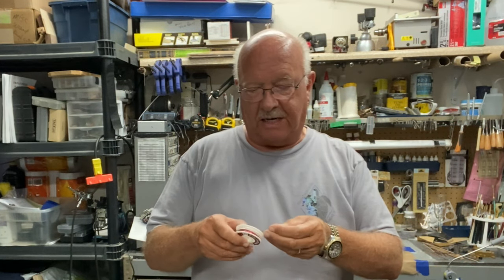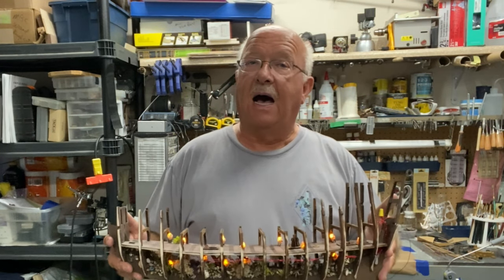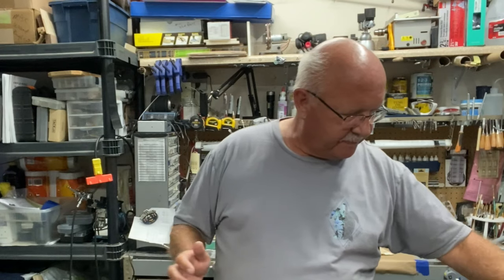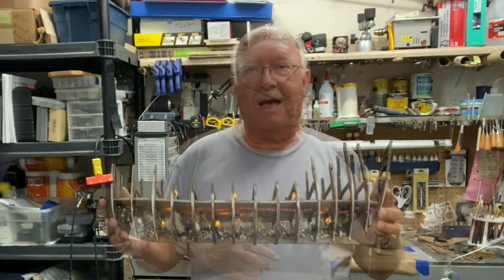The next area I had difficulty with was wiring. I had gotten this magnet wire — it's enameled wire with a thin coating of enamel so it won't short out. Very thin and it works great in tight spaces. The problem was I used the same color, so it could easily get mixed up as to whether it was the positive or negative lead. I thought I did it right, but unbeknownst to me I had a short in the little electrical transformer. Sometimes it would work, sometimes it wouldn't, and I thought the light or wiring was bad. Several of the lower level ones I pulled all the wiring out and restrung it before figuring out it was the transformer. But I have them all working now.